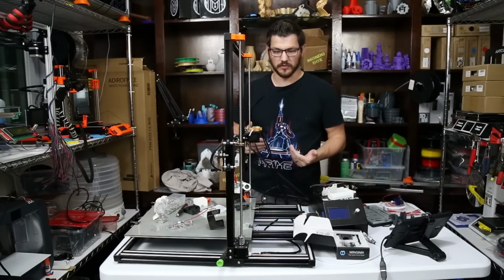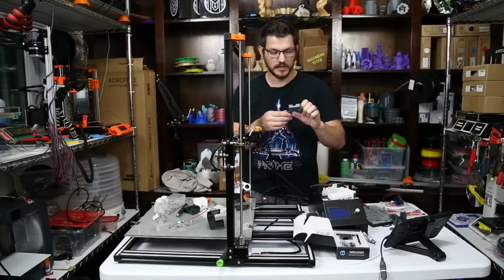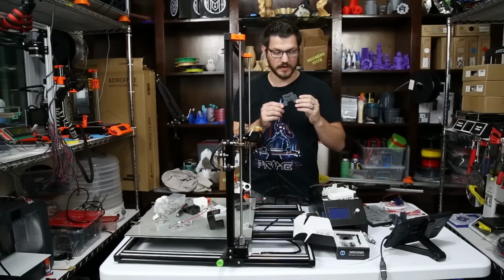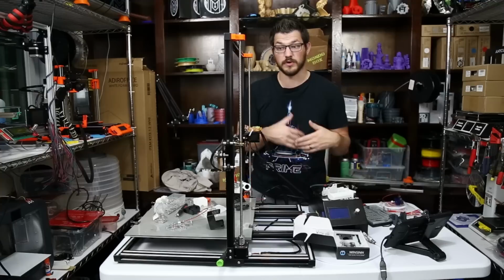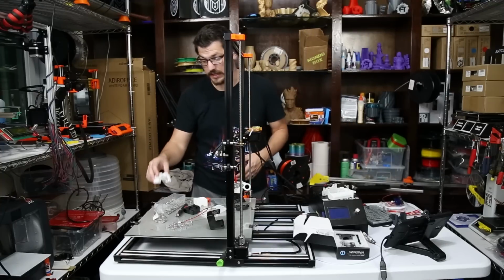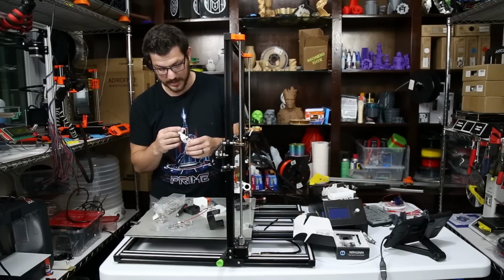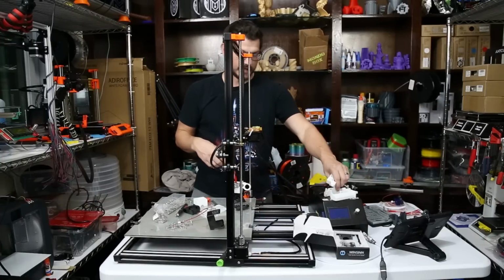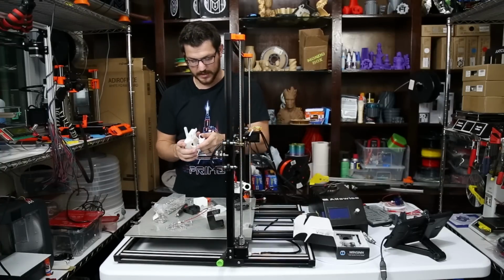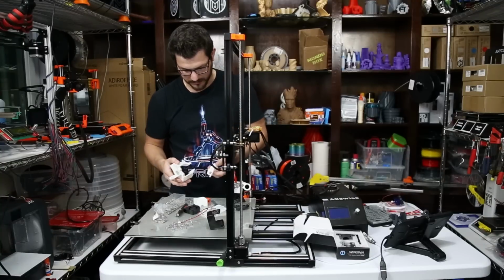We're gonna go back in time a little bit, because I actually had some problems with the PETG parts. They were not matching up the way they were supposed to, so I thought I printed the wrong parts. I went back and reprinted some of the parts again in PLA. Now, my problem is that one kept failing on me because it didn't have much support to it. And the other problem is that once I am actually lining all of this up, the holes are still not really matching up properly.